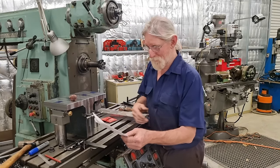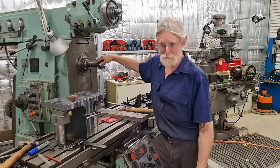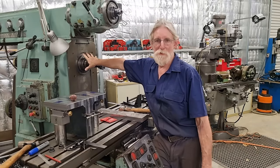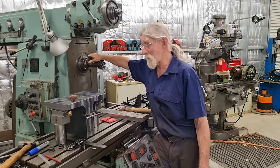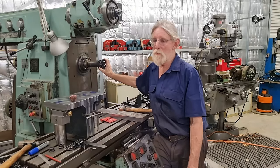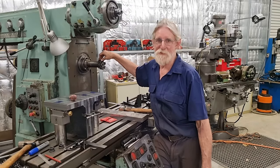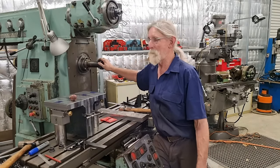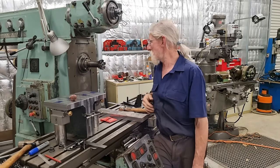Okay, last one. People think because I have this long extension coming out of here with the cutter, that's going to cause chatter. Not in this machine. These have got huge spindle bearings, and this is a big solid extension. It's a proper extension. Running this small cutter on it, no problem whatsoever. I could load this up to its maximum depth of cut of 7 millimeters on this cutter, and she won't bat an eyelid. You won't get chatter from this. So that's the way it is.